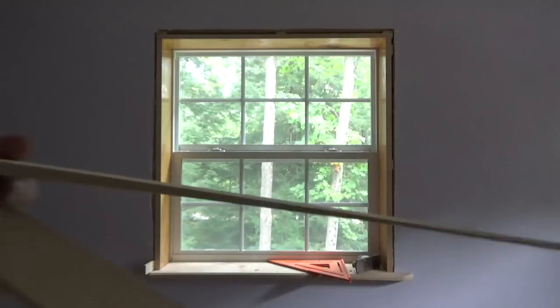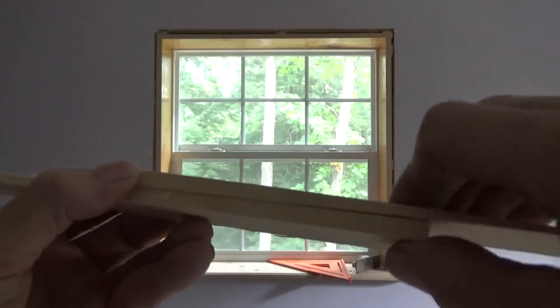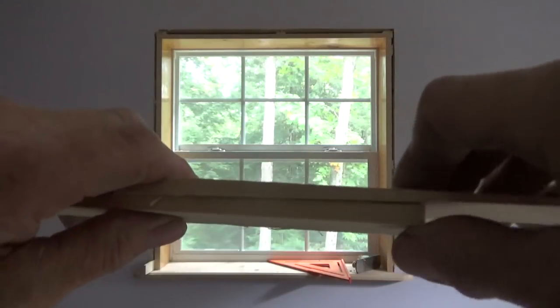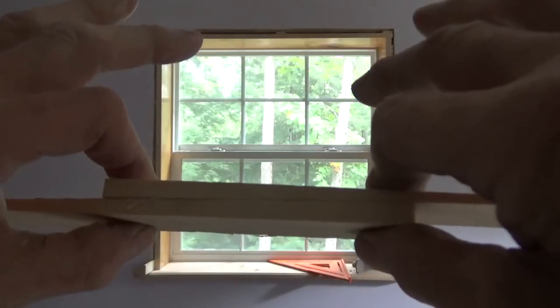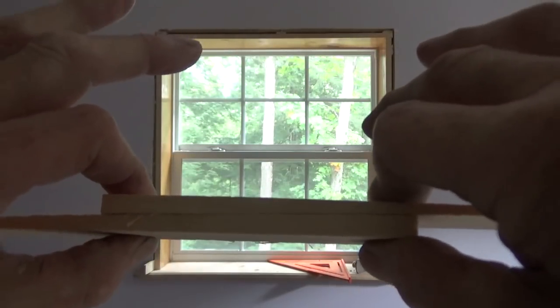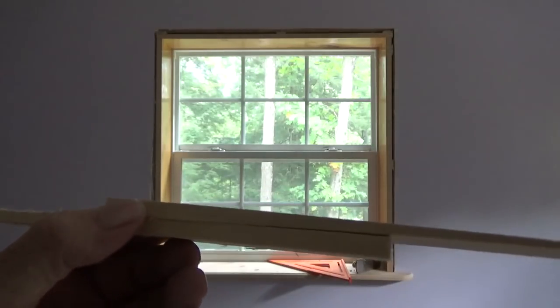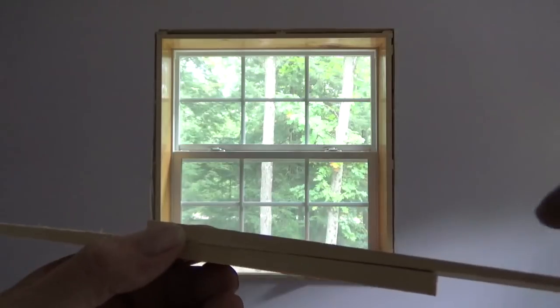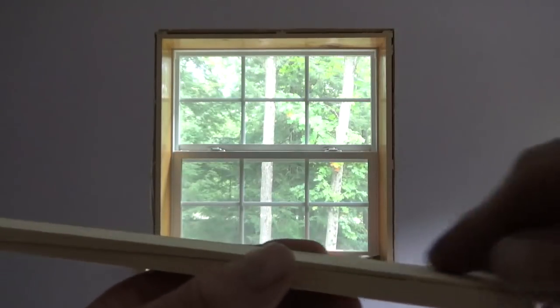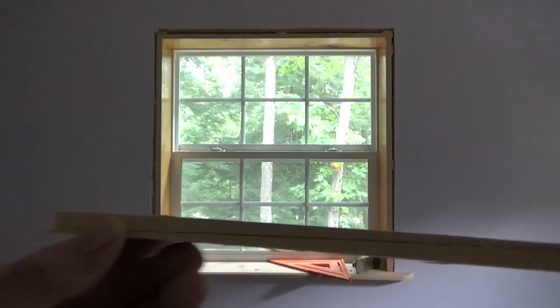Now, a good shim pack is cut in such a way that for a doorway, I mean, a 2x4 wall at 3.5 inches, they're assuming that there's no gap bigger than 1/2 inch, okay? Now, you gotta use shims in sets of twos. If you have a bigger gap than that, you're gonna have to put 4 shims, because if you don't, when you add another shim to this, you make a bevel rather than a straight piece.